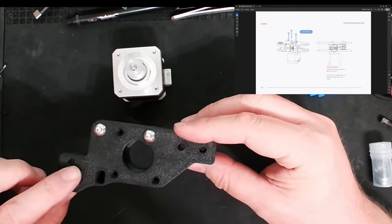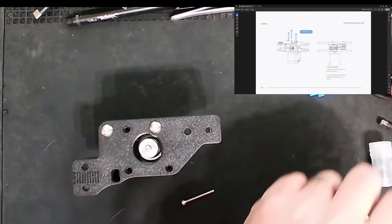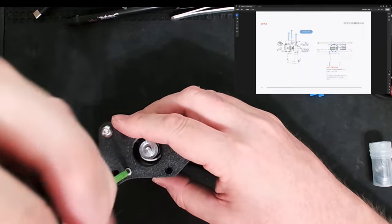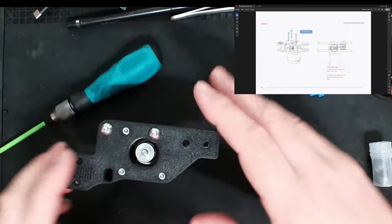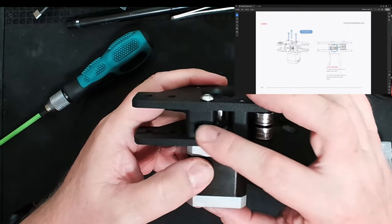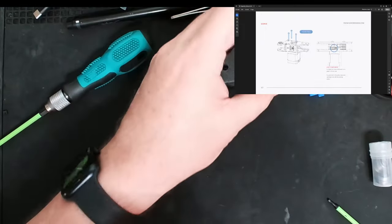Let's set this down and put the motor together. The textured part needs to be away from the motor connection. I'm slipping this down and using M3x30s to screw the motor in. On the first screw I'm not going too tight. I'll tighten the second one, then tighten them all up. Doing a visual inspection — checking that the gears are even with the bearing. That looks pretty good. Just making sure everything turns. We have all that together.